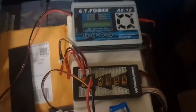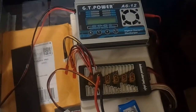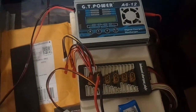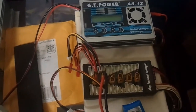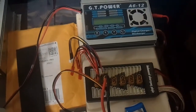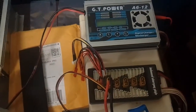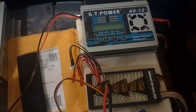Now for a follow-up to the first video. Within the first minute the charger discharged at 2.2 amps — 25 watts — then overheated and I immediately restarted it. At that point it would not achieve a 2.2-amp discharge anymore. The highest it would hit was about 0.5 amps, which calculates to about 5.8 watts — nothing near the 25 watts it's rated at and did do for that first minute.